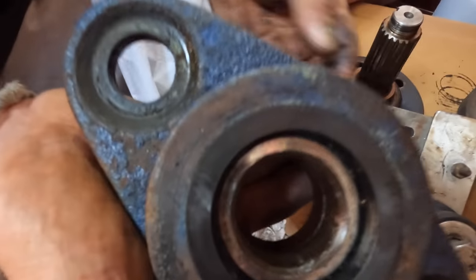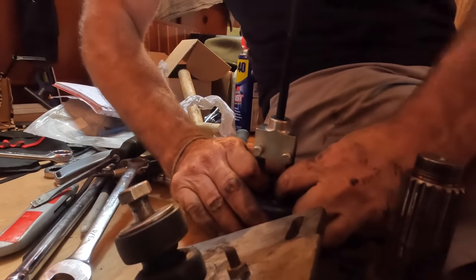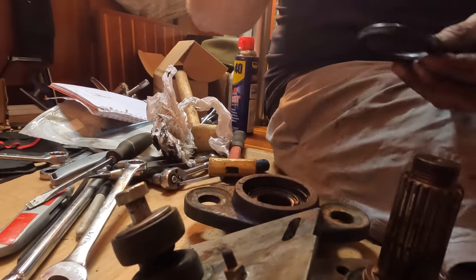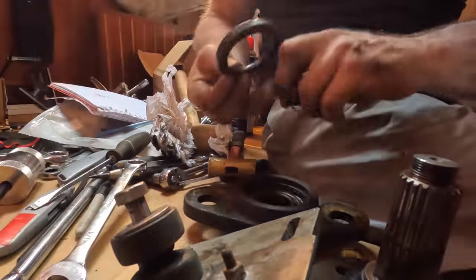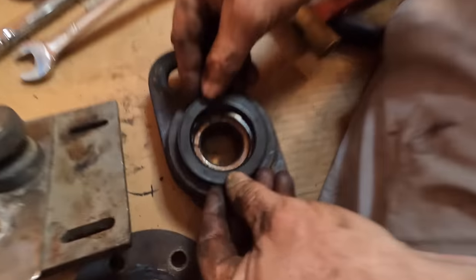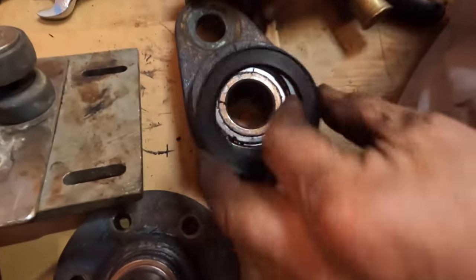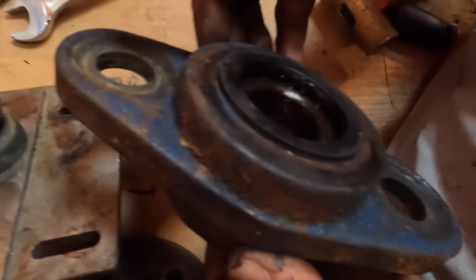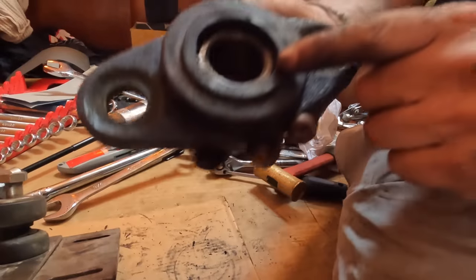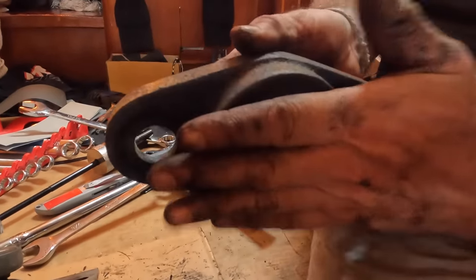Okay, this one has definitely worn off but this one isn't — can you see all those numbers on there? The one that has nothing on it has come out where there was a gap in the bearing, so the one which has got a number is tight. I think that's the front, towards the engine. So I've removed the retaining clip — holds it all together. We'll put that on our tray of goodies. Pretty heavy duty — I don't think we'll need to replace that.